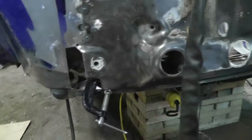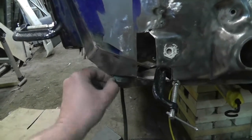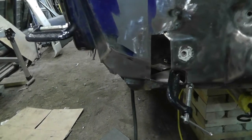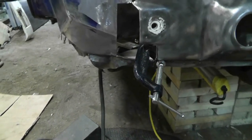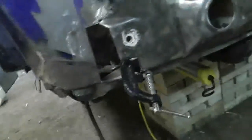Okay guys, that's it for today. This is tacked along here, this is still tacked along here, and I didn't fully weld it. This bottom piece and this front piece are welded between here and here, so they're technically one piece now. I still have to trim off some garbage and round this corner off. Next I'll fill in some of these spot welds along the front to lock that into position, then do my spot welds along the back where I've got clamps, and then start filling in the weld along the bottom and the front.